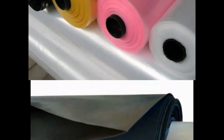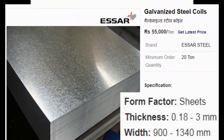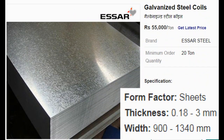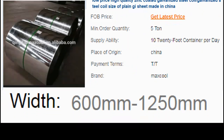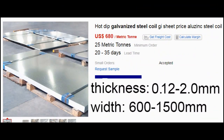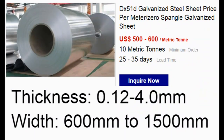Unfortunately, the usual width of polyethylene sleeves is 150 centimeters, while steel sheets or coils are typically 100 or 125 centimeters wide. Effort must be made to find steel and sleeve of equal width to avoid spending time cutting steel sheets.